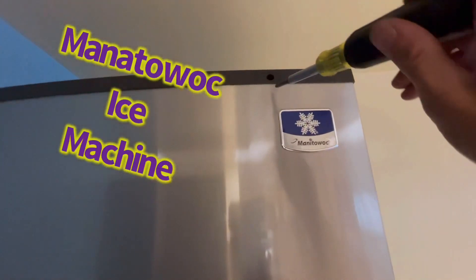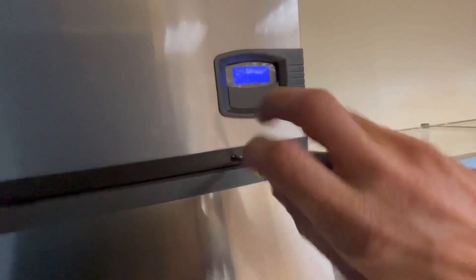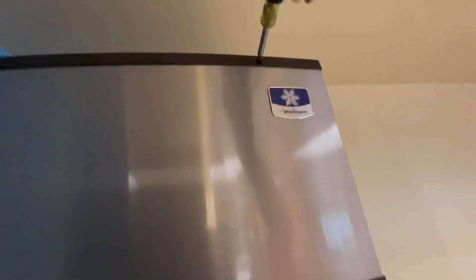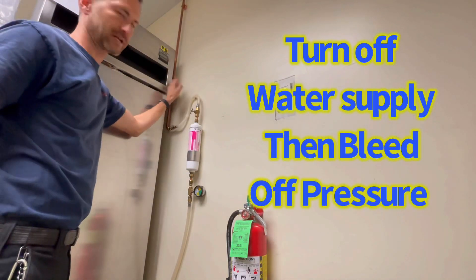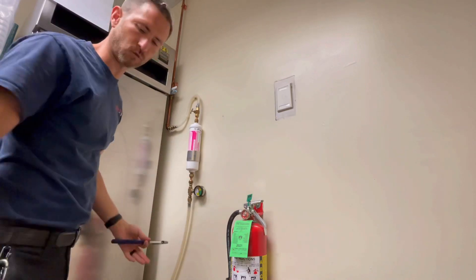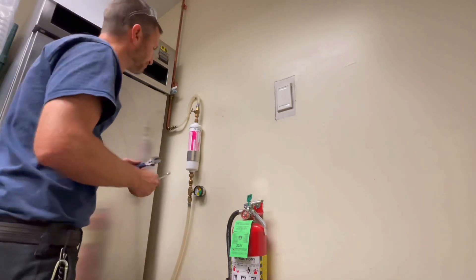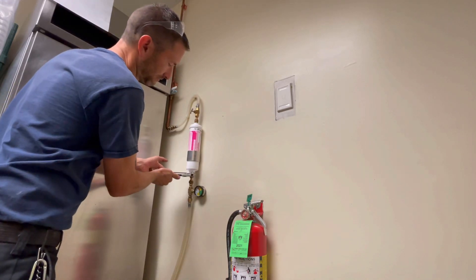Come up and loosen the screws. Okay, shut off your water — you can shut it off from an auxiliary source or right there at that convenient point. Now we'll go ahead and drain this down. There is pressure in here so you're going to get some water on the floor regardless — it's going to happen. If you can grab a mop ahead of time, or some cardboard, just to try to soak it up, that would be great. We are valved off so we're going to drop some pressure here. Remember: righty tighty, lefty loosey.